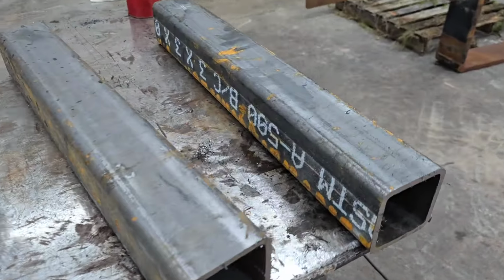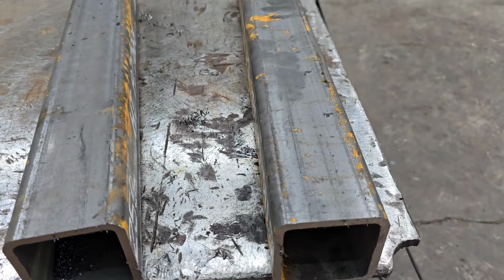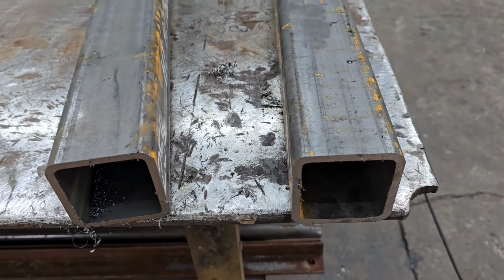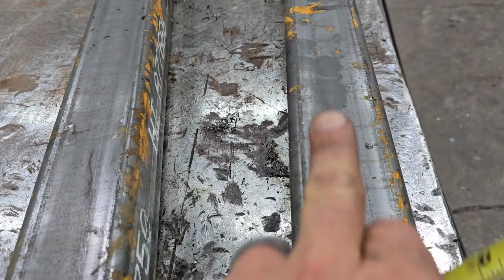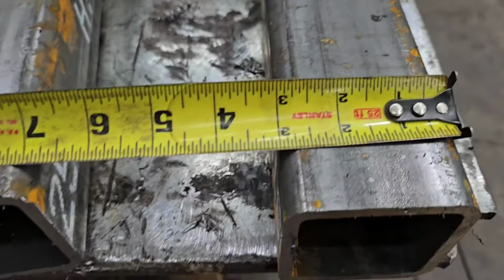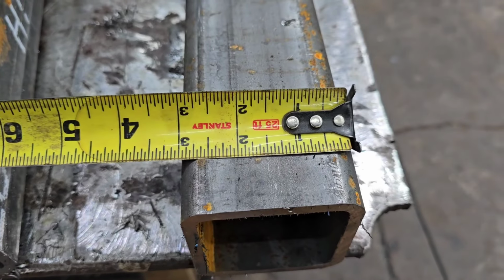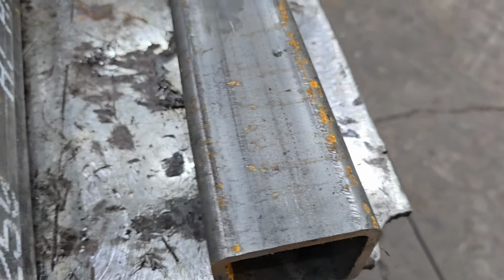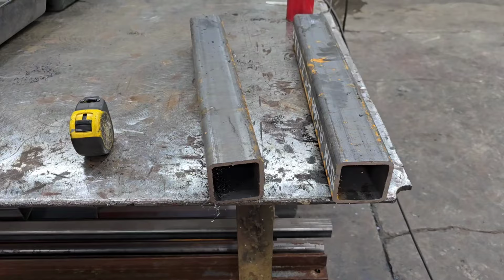And that does leave the back on a tube that's 3 inches wide, that'll leave the back part kind of thin, which is no problem. The strength we need to lift something is going to be pushing up, so back's not a problem. And what I'm going to do, I'm just going to ignore that side that I marked and mark new marks on this side. That'll be 2 inches this way and 2 inches down this way. And then we'll drill those 15/16 and we'll call that disaster averted.